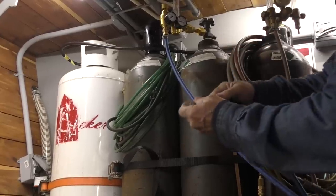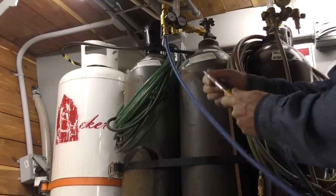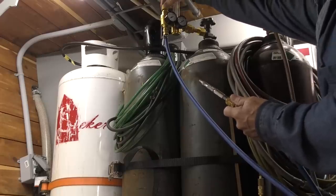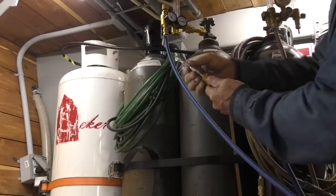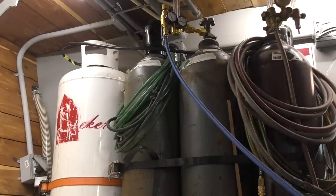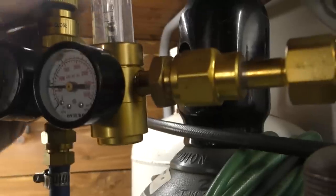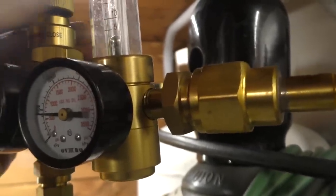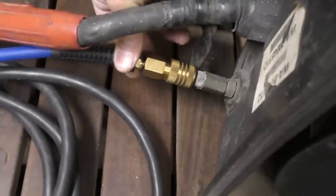I can troubleshoot that by putting an air nozzle on the end of the CO2 line. I was turning it the wrong way — I want about 20 right there. Now, 20 on this may not be 20 on my gun, so we'll set it back up. This connector is really springy, so I think it may be a problem there. With one person I'd just shove it in tighter and ask somebody, 'Is it flowing now?'